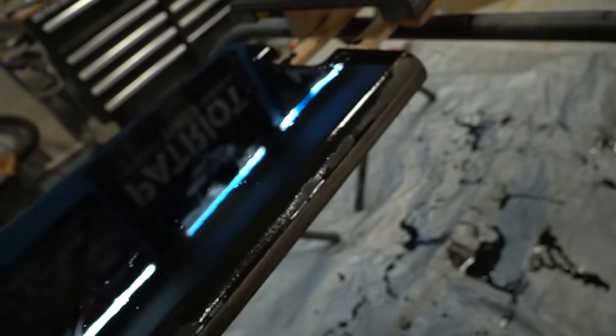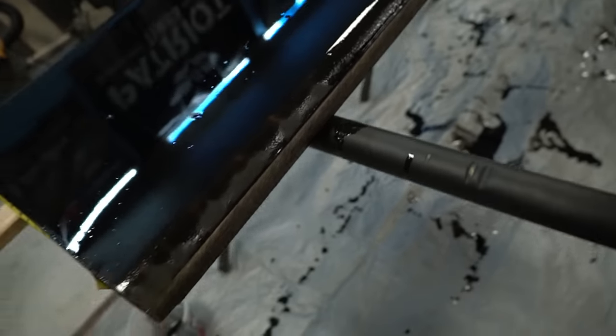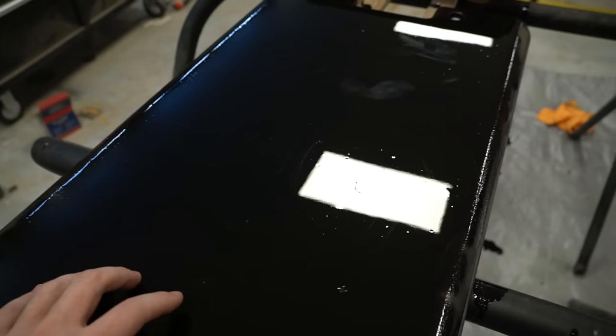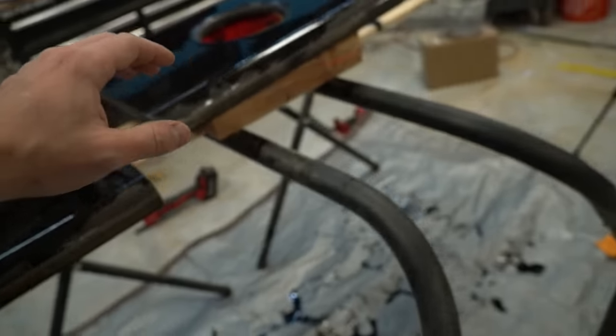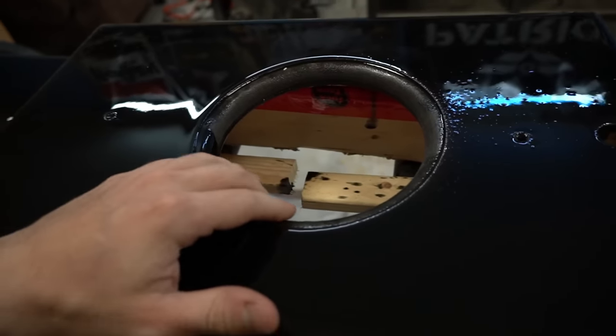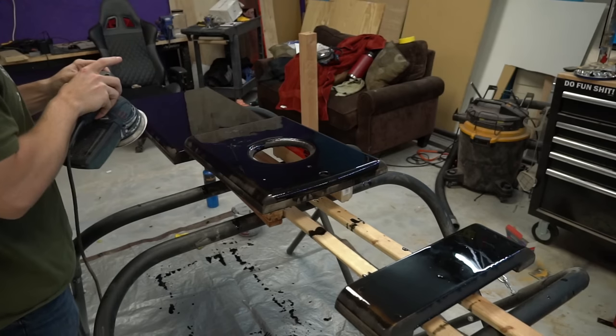first time, because that's the exposed grain and that's gonna absorb more than the flat MDF will, or the flat wood will. So I am going to sand this down a little bit, get it nice and scuffed, and apply a second coat. This will probably take three, maybe four coats to accomplish what I'm looking for here.